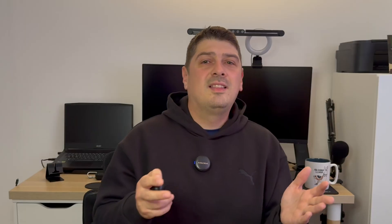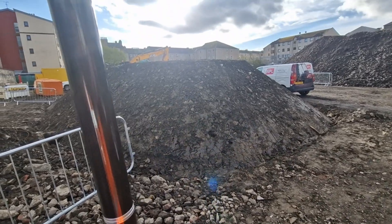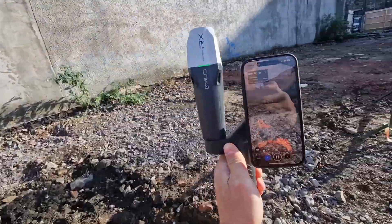I see this kit's practicality sitting somewhere between an RTK drone and laser scanning. It doesn't cover as much area as a drone, but you're not dependent on weather, flight restrictions, or expensive training. It's not as accurate or detailed as laser scanning, but it's far cheaper and more practical in many situations. Compared to other GNSS systems that integrate with Pix4D Catch, the Emlid and Pix4D scanner kit includes a professional GNSS receiver you can also attach to a survey pole for land survey projects or drone GCPs. If you're a small business, a surveyor looking to expand your capabilities, or even a newcomer to surveying, this could be a practical, versatile tool to keep you competitive.